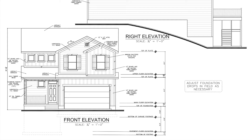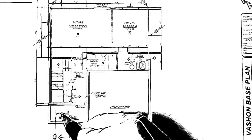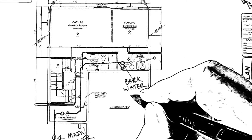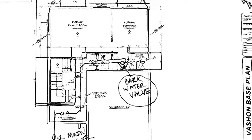Let's join Plumber Tom as he just finished the underground piping for this two-story house. A quick look at the plan reveals an unfinished basement with a future bath and a mechanical room behind the unexcavated wall of the garage. On the main floor, we find a half bathroom by the three-car garage and a kitchen sink towards the back of the house. The second floor has a large master bathroom with multiple fixtures, a main bathroom, and a laundry. The main sewer line comes in through the front under the cold storage. He'll tie into the main sewer, run the building drain through the hallway, under the future bathroom, and into the mechanical room. He's putting the backwater valve in the mechanical room — excellent move — so all basement fixtures would then be on the backwater valve.